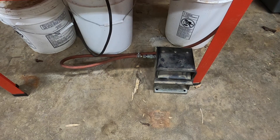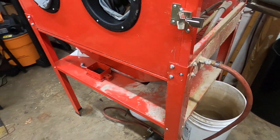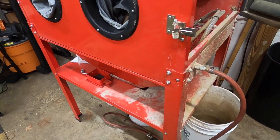This is a pneumatic foot valve that I got from another piece of machinery. I'm going to try it on this — hopefully it works pretty good. You definitely need something like this, otherwise you go through all your air in no time because you have no valve. This will really make a big difference in air conservation.